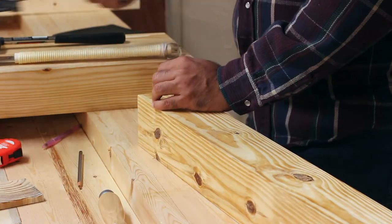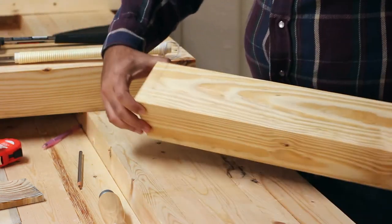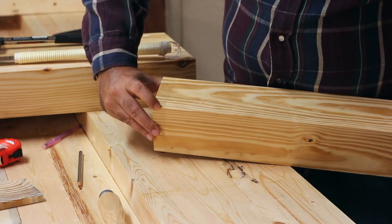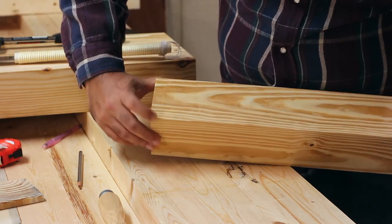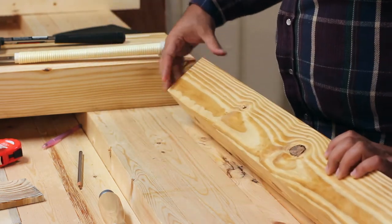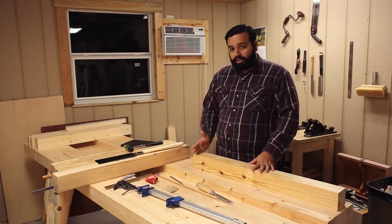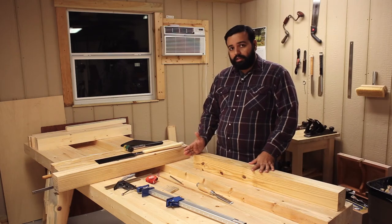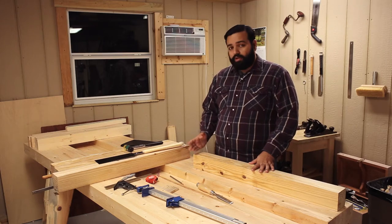I'm going to show you what I got here. There's a perfect meet at the corner right here, where the two sides met, which means that my sides were pretty well planed. Why do I do this knife wall? Because this is a cross cut. I'm about to do a cross cut sawing against this side, so I don't want any breakout.